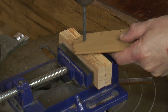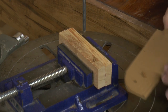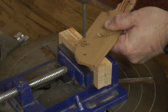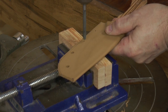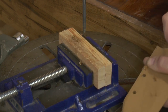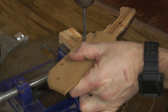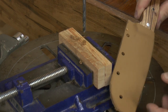Going to drill our holes. In this case, we're using a drill, KYDRL8, because we're going to be using number 8 eyelets. And this drill is specifically made for punching right through that Kydex. It's got a nice point to it so that it doesn't bounce around on your plastic.